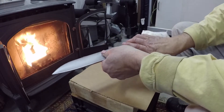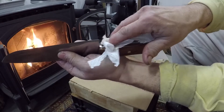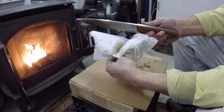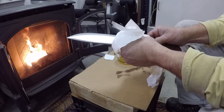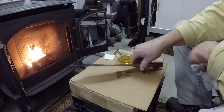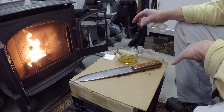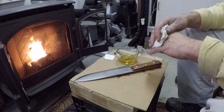It really pops the wood nicely. Oil here looks really nice. I will let it soak and then maybe do one more coat of that. Then I'll mix shellac and linseed oil — half and half — warm it up, put it in, let it dry, clean it, buff it a little bit. And that's about it.